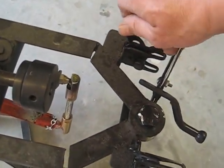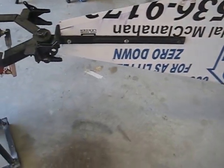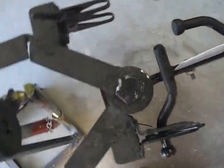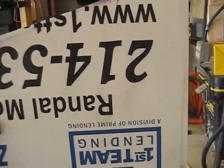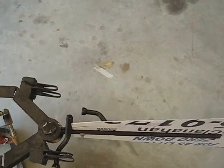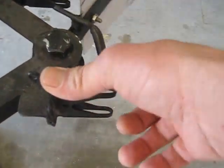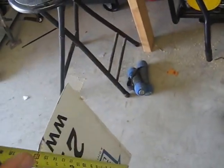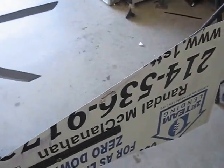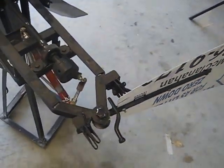Once the wind has slowed back down, lock it back into place. As you can see, the tail assembly was made using two pieces of flat steel welded onto a small spacer, and then a sign was cut down and is held in place with three screws. It's quite a simple configuration. The overall measurements of the tail are two feet long by 15 inches tall. I've cut it a little — it may not be large enough. I won't really know until I get the whole assembly up on the tower to see it blowing in the wind.